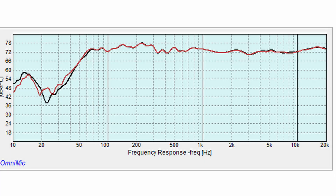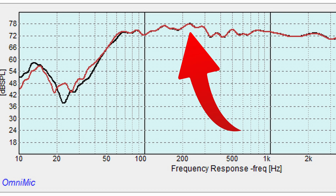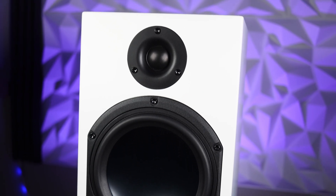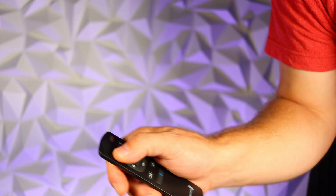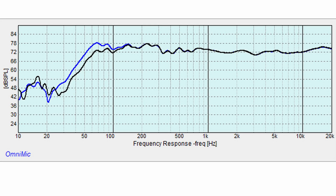None of this matters if they don't sound good, which means we need to talk about the frequency response. The frequency response is relatively linear, except for the low end, which has a bit of a boost in the mid-bass. This is really surprising because these Signature woofers really aren't known for their bass — they're not a driver you would typically choose in a design for bass. Yet when listening to these, the bass is tight and refined, something I just didn't expect. The bass was unobtrusive and never lost control of the woofer. And if you really like bass, you can hit the bass boost button on your remote control, which will increase your bass even more, taking your typical F3 of around 60Hz to an F3 of 46Hz.